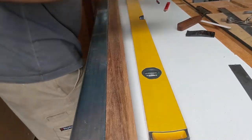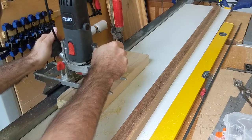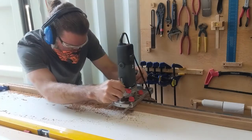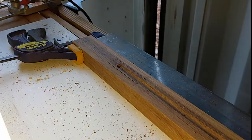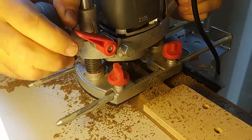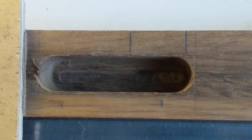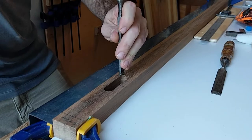I'm still using this steel bar here as a straight reference guide. I've set up this jig with the router edge guide, using the steel bar as my straight edge, and I had a test piece just to make sure that everything was going to be accurate. I needed to make sure that this track was deadly straight — it's the most important part of this build. Any wobble, any variation would be catastrophic. Ideally, a router table would have been a better option if I'd had one.